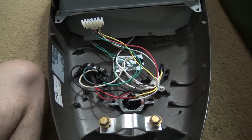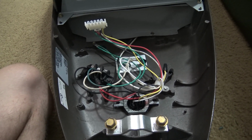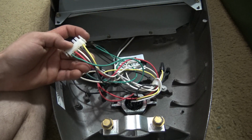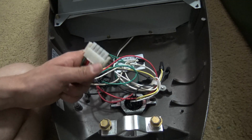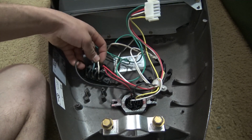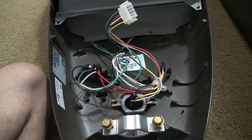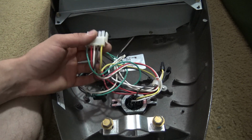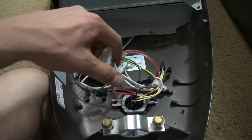But basically, how the plug and assembly work on this fixture is you've got your hots that come out and your lamp wires that come out of the front, and they actually go up into this plug here. Now I do actually have this one grounded, as you can see, that nice little green wire right here. My other one isn't grounded just because I didn't have all the right connections to do so. But usually these aren't really grounded, I guess, so it doesn't matter. But pretty nice clamp, just a simple plastic clip.